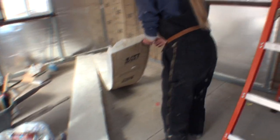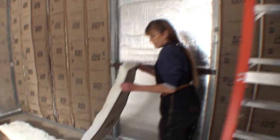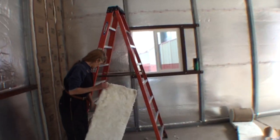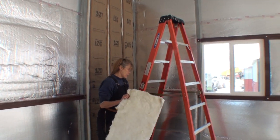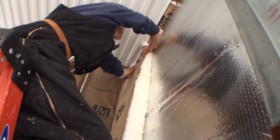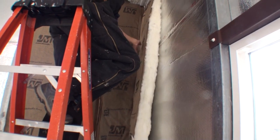Is the insulation long enough to go up inside the ceiling and touch? About two inches. Once you've sprayed it, it's pretty much ready to go. The only thing you want to be careful of is not touching anything else because it'll stick and pull off — it'll be a big mess. So far that hasn't happened. Then I just fold the top back a little bit so I can stick it up under there, make sure it's tight up against that stud, and basically you're done.